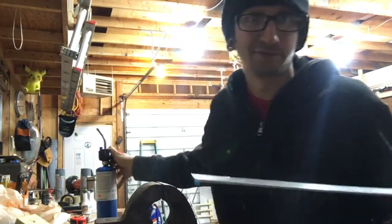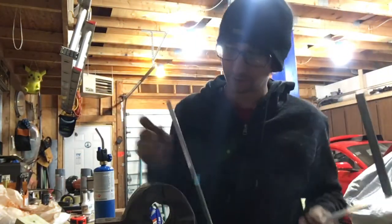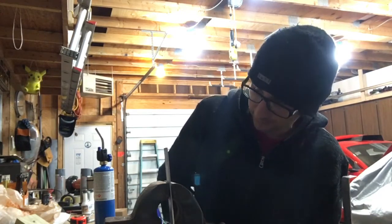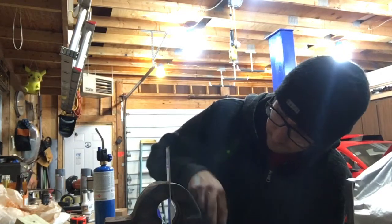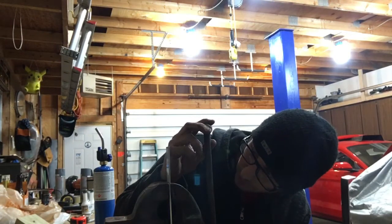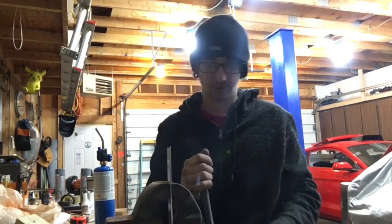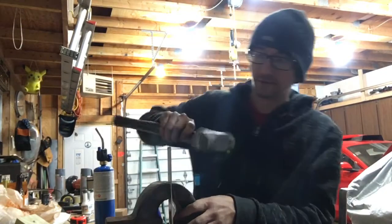When the gas shuts off it's ready to go — well, not really, but you know. Let's find my scribe marks right there. I'm gonna line it up in the vise. Make sure your marks are completely level, otherwise your bend is gonna be a little crooked. You can fix that, but it's easier just not to have that happen. Now that I've annealed the metal...